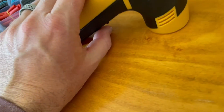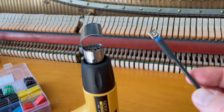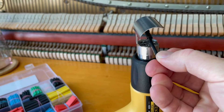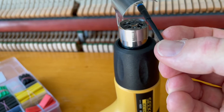To activate the heat gun, we'll come down here to the little button — I'm going to flip it to the run position. After just a few seconds, I'm going to take my wire and my heat shielding and stick it just right underneath here. You can see that we'll go ahead and rotate, and you can see that already shrinking into place just that quickly.